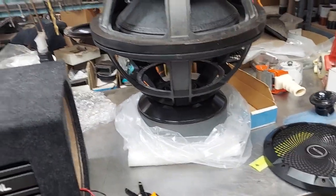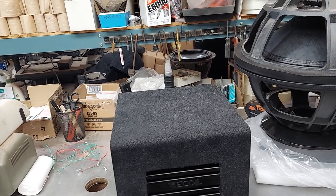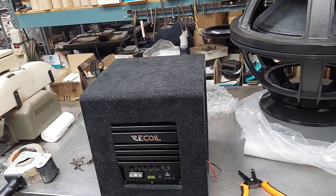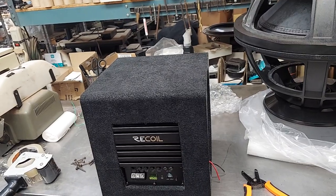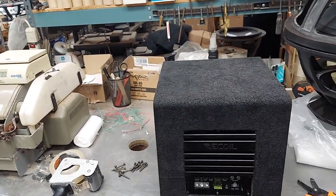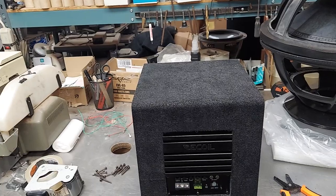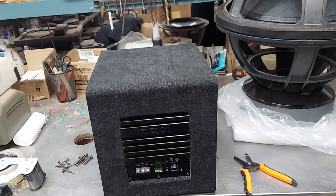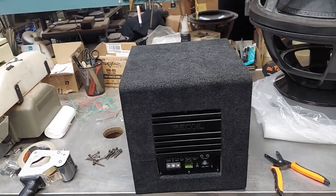To tune a passive radiator, it helps to know what the subwoofer wants as far as parameters. For most woofers they're pretty much all about the same. For a 10-inch, it's good from about 0.85 cubic feet to no more than about 1.5 cubic feet. You should go by the VAS — the VAS is the largest airspace required to reach FS, and FS is the lowest frequency the woofer can usably play. The box recommendation should be based on or around the VAS of the woofer, the compliance.